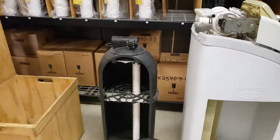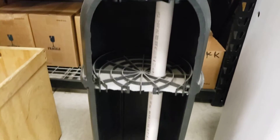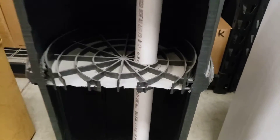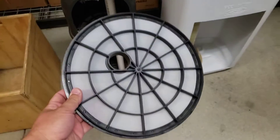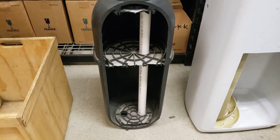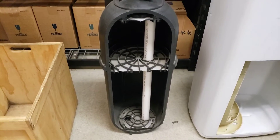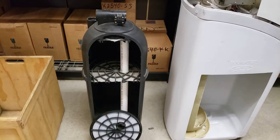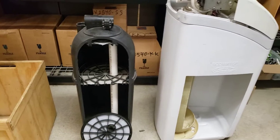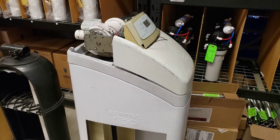First thing we'll look at here is a WaterMax. As you can see in this cutaway, it's kind of dusty, but there are actually different screens in here. The purpose of these screens is to keep the medias separate. There are three to four different medias, sometimes five or six, that we put in here depending on the water quality. Each of the medias has a different weight and a specific order we want to run the water through.